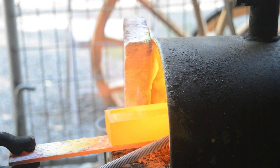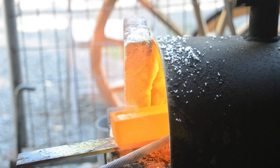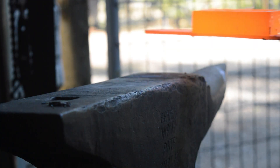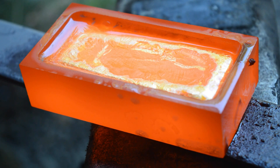I'm also going to apply some borax flux. This works best in the last few heats — when you add your last little bit of brass, you apply this at the very end. It puts a nice coating over the top of your brass bar when it's in liquid form and keeps it from oxidizing, which mitigates holes and pits in your bar.